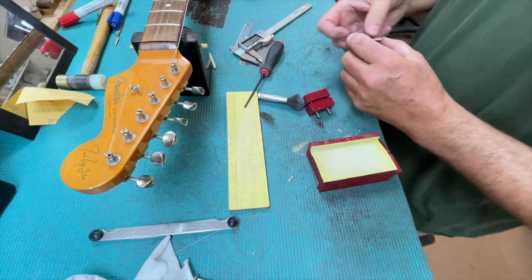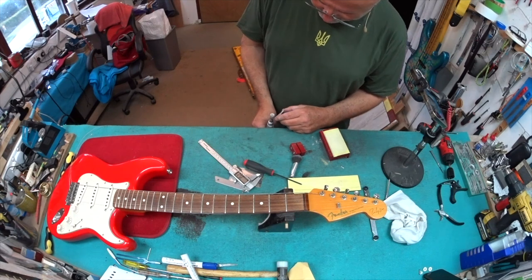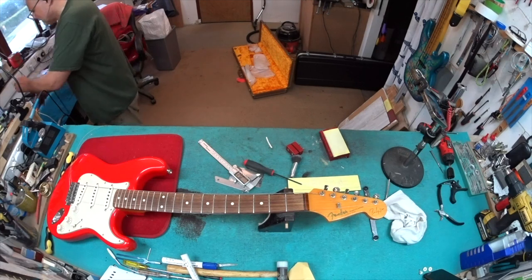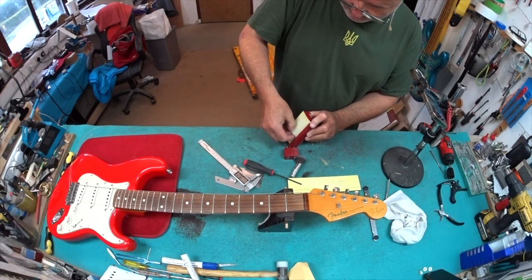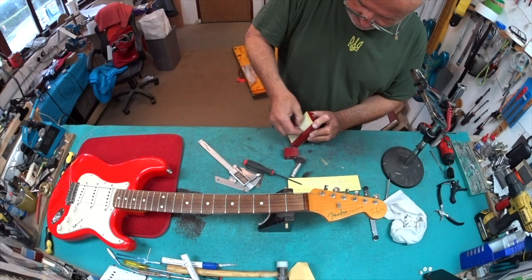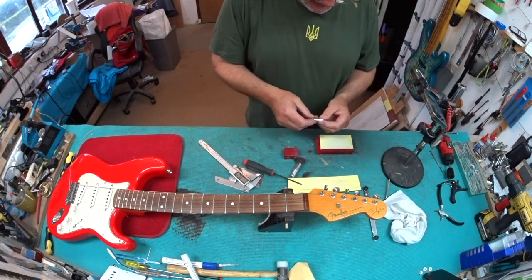I mean, if we were feeling brave, for example, we could get the Dremel out here and take a little bit of bulk off, and you'd have to be very brave to do this. As I am now demonstrating. So I've taken a big risk in bump starting the sanding. And now I'm going to run this up by hand just to get it down to the curve. That's the radius curve. I'm controlling it with the pressure I'm putting on it by hand, and it's harder to hold, but it means I can stop more often and do the measurement.